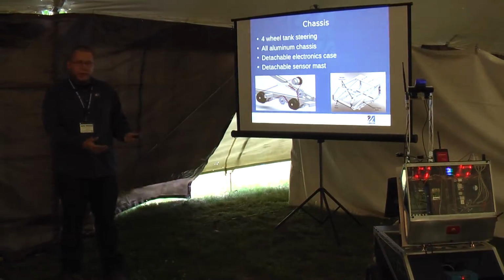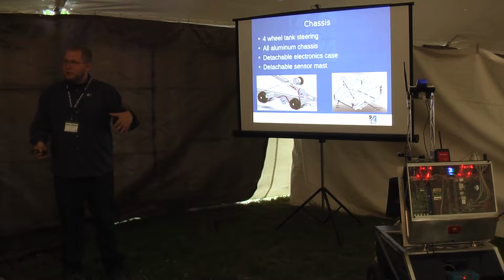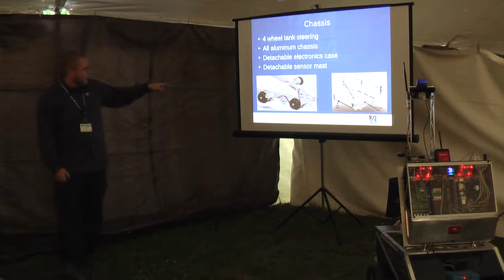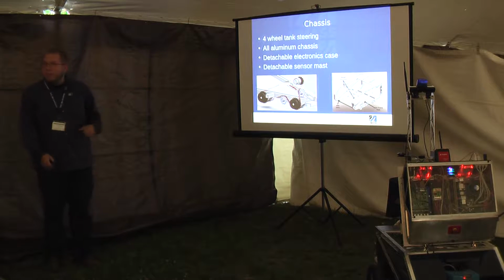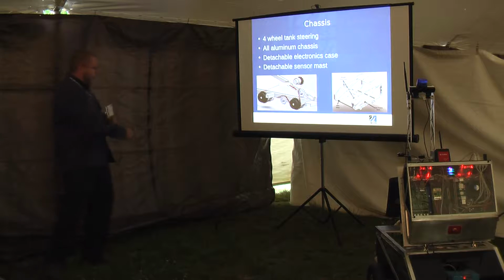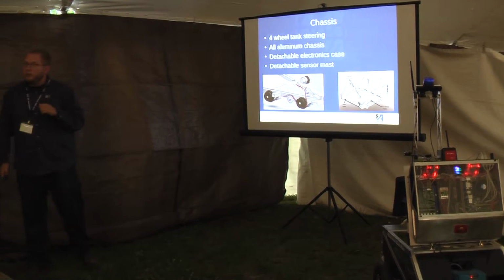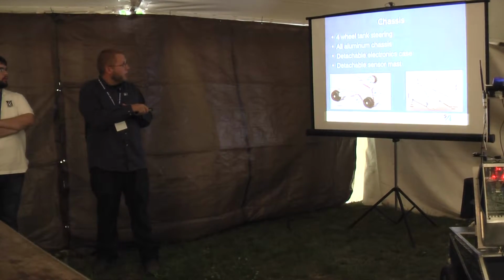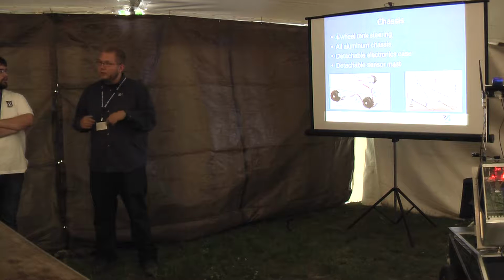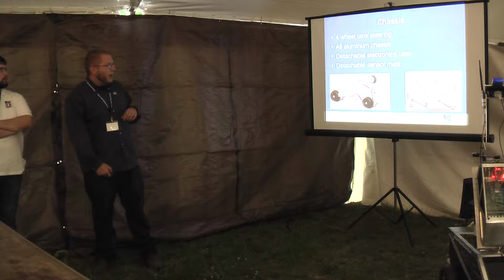Start is a four-wheel drive tank steer robot, meaning it can turn within its own frame size. To do that, it has a gear system like this. This is set up on both sides. Each motor runs on each of those idler pulleys, which is run by the motor up here. And there are two idler barrels that allow us to tension to get maximum chain wrap around those.